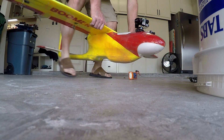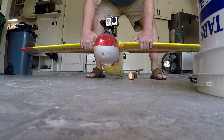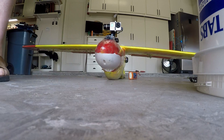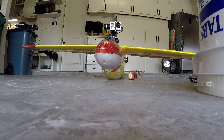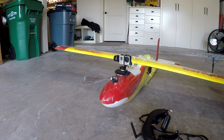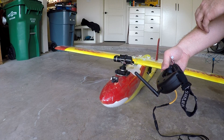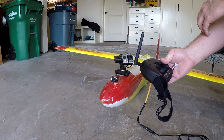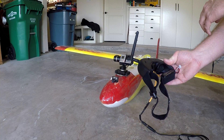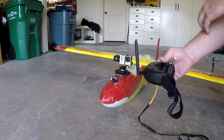What I'll show you next, after I put this down, is the setup with the head tracker. The way the camera pans is it'll pan continuously right or left depending on the signal it's getting — it doesn't follow the head tracker position directly. When I first hook it up, the head tracker is pointed a little to the right and it's panning continuously to the right. To stop it, I have to go back to wherever the head tracker thinks is centered. The tilt works normally like a regular pan-tilt setup.